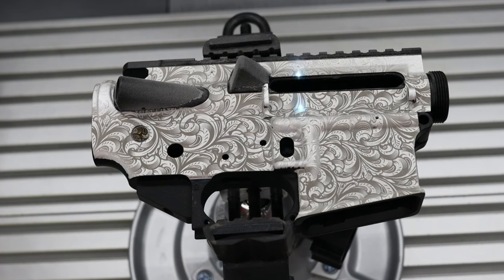It can if you have a more powerful laser. Like, I have a 50 watt. If I'd have known that I needed to get bigger lenses, and if you use bigger lenses, you lose power, I would have probably got 100 watt. But you'd still be looking at time. You don't want to cook it all in one go. I don't think that would turn out well. But you can. I mean, the depth on it, y'all can't really tell. It's still deep enough that if you run a pan across it you'd notice it, but I want to go deeper.